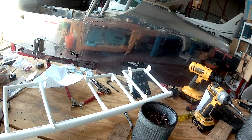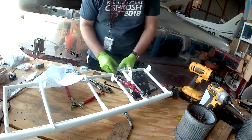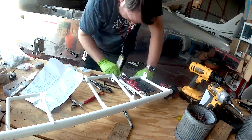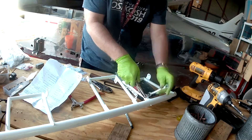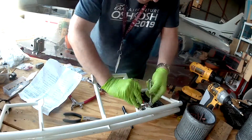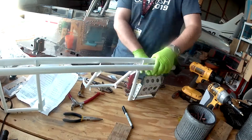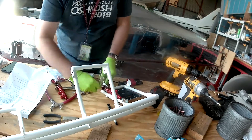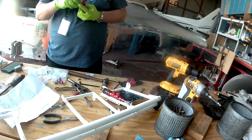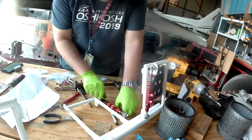Everyone's going to be adjusted a little bit differently. If you don't need the brakes, why would you ever touch the brake pedals? The bottom bar is the rudder, so as long as the two rudders are lined up neutral and equal, great. When you put your toes up to reach for a brake pedal, you want both to be in the same plane — you wouldn't want one tilted 15 degrees backward or forward. The side frames don't matter; you're pushing on the bottom bar and the brake pedal. Technically you'll feel a slight difference between left and right foot because one fulcrum rotates from a position farther behind your toe, but people say they can't tell the difference, so it's trivial.